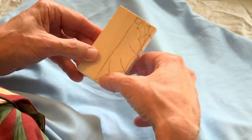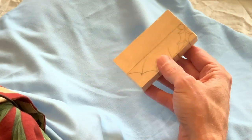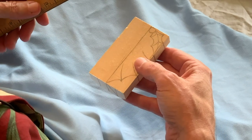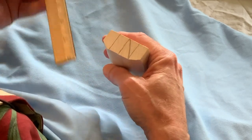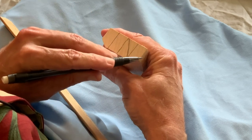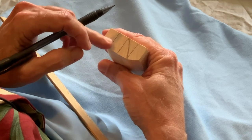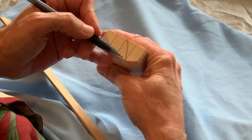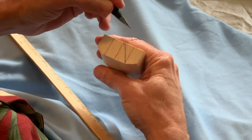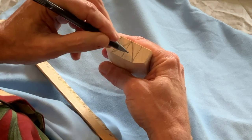I've made some pattern drawings on one side of the carving, and I'll show you how to set that up on the other side. First, make yourself a center line on the piece of wood. Then we're going to come in half an inch — 13 millimeters — from each of the outer edges at the bottom and make a line. Then draw an angled line from the center line to the back of each side to create that triangular foot.